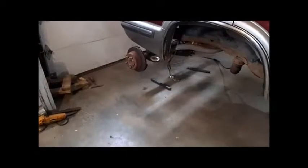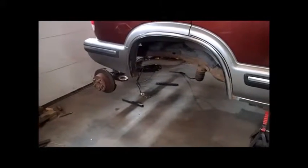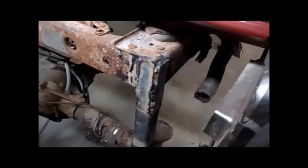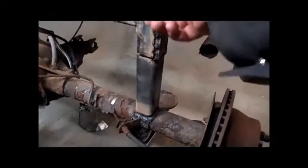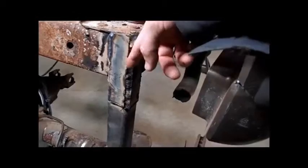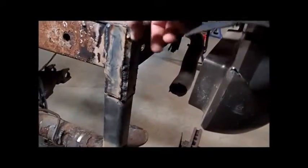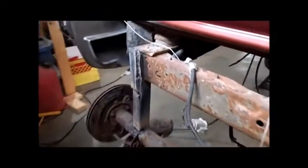All right, so we're going to do a little update here. It's a couple days since I took the last video. We've got the axle mounted now. As you can see, it's reinforced. We've got some two-inch square tubing, welded to the axle, and the middle of the actual frame is quite a bit thinner than the middle of the square tubing. So we put a couple pieces of flat bar, welded it to the frame as well, both sides. So that's done.